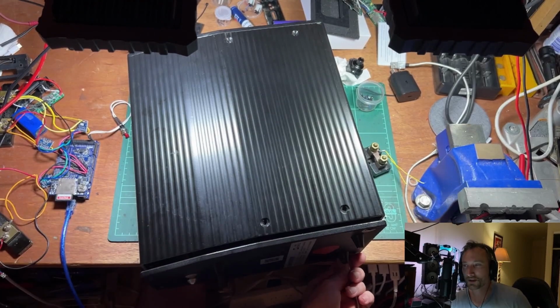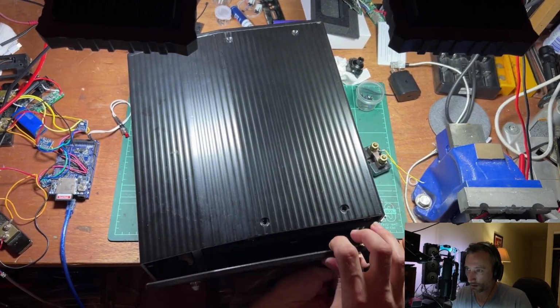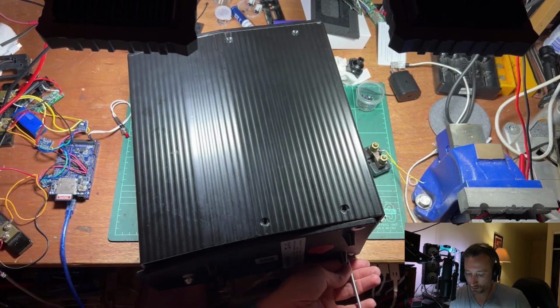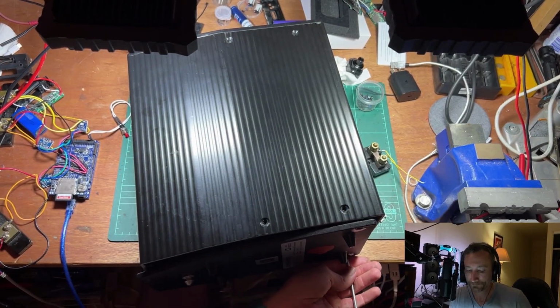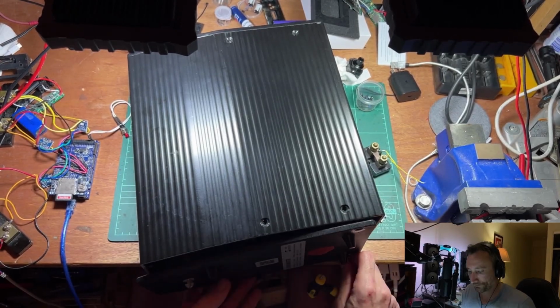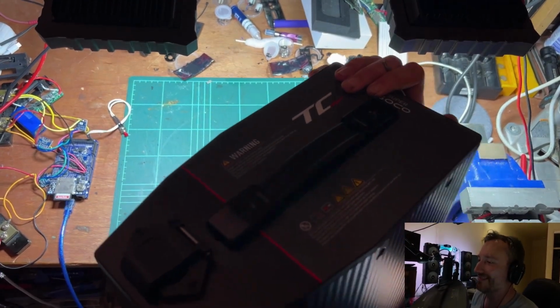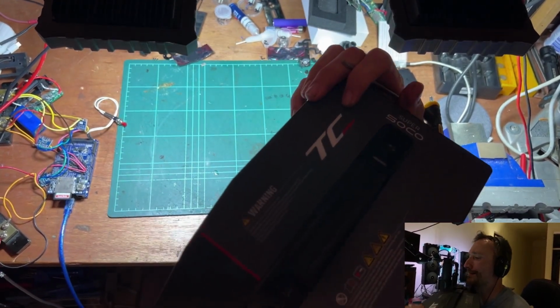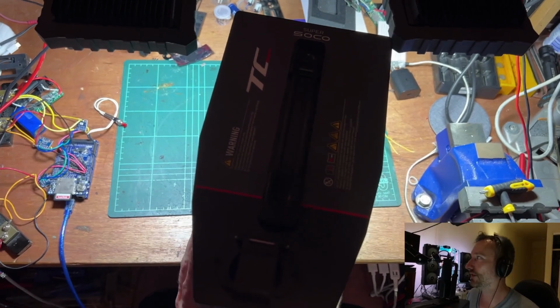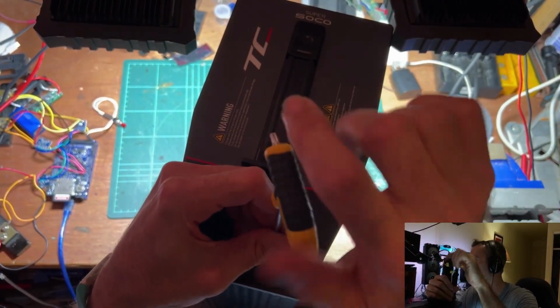What's actually concerning me a little bit is that as soon as I cracked this bottom panel open, I got a whiff of a chemical smell, which smells like electrolyte to me. And that's normally quite a bad thing. That normally means something, like a cell, is ruptured. So we're going to proceed very gingerly. Yeah, the thing's hard to move around. Did I mention it's 22 kilos? Okay, I'm fine. Maybe. We'll just undo all the bolts up here.